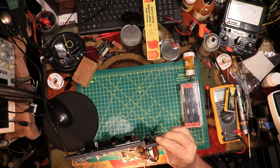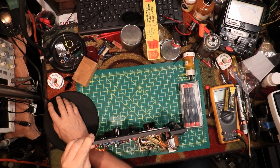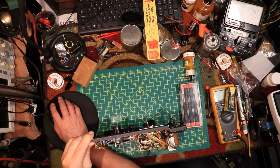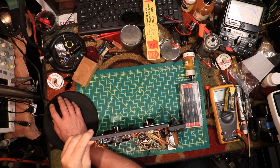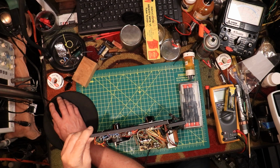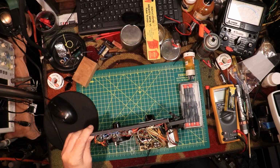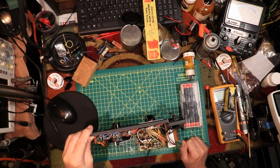That would make sense. Because it's coming from the normally closed switch for the emissions, it goes to the normally closed on the grid. And then out of there... What am I seeing again? Right there, it goes straight up. Yep. And it's gone. I bet that FET is kaput.